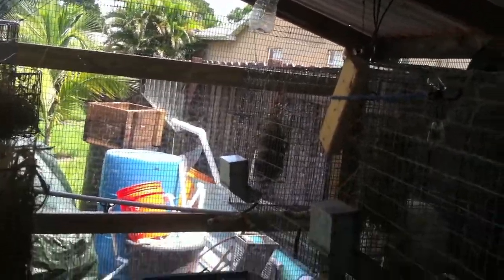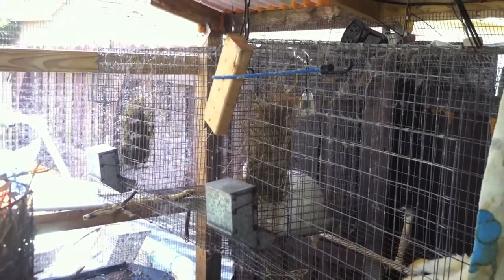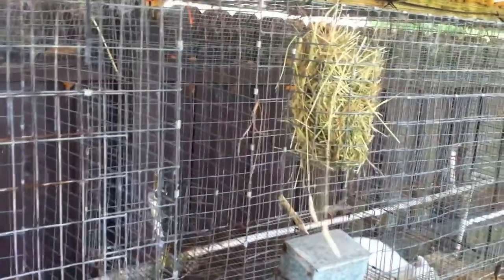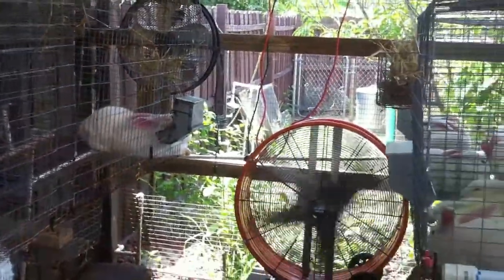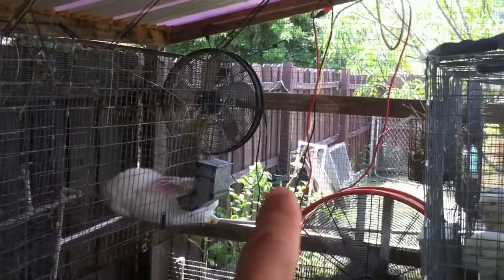Because the misting system only puts out very little water, it doesn't break the valve and it won't close because there's not a lot of water coming out of it. So I had to double up on the spring inside the valve to be able to provide more pressure to help the valve close when the thermostat says to turn it off. The sprinkler valve runs off 24 volts.